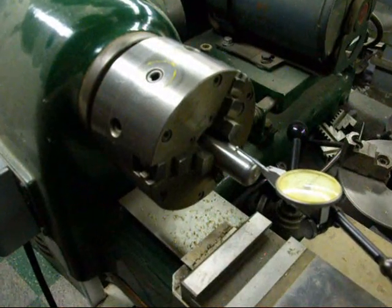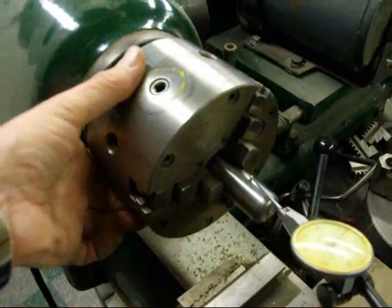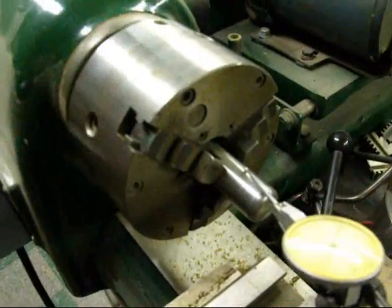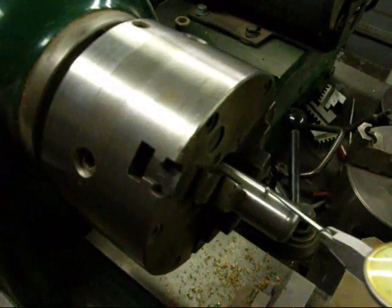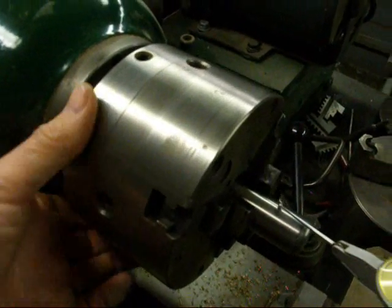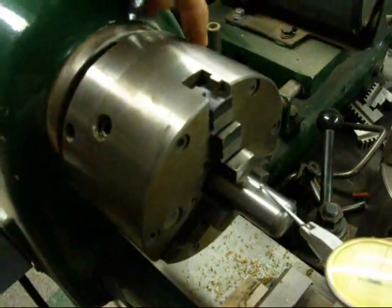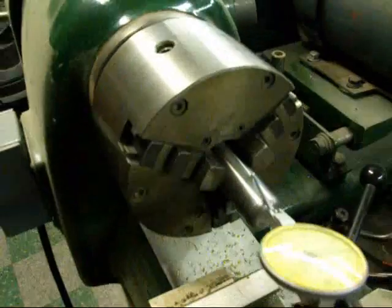I can see this video is going to run a lot longer than I want, so it might have to be in two parts. I wanted to tell you something about this chuck. This is a very expensive three-jaw chuck on this Hardinge lathe, and in fact it's called an Adjust-A-True chuck. It's a three-jaw chuck mounted on a plate that really makes it, in a way, like a four-jaw chuck — we've got some bolts out here that allow us to adjust this chuck back into a true zero.